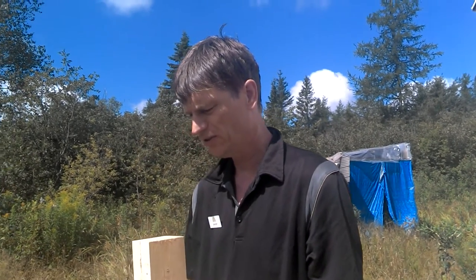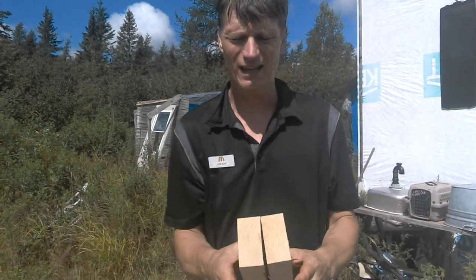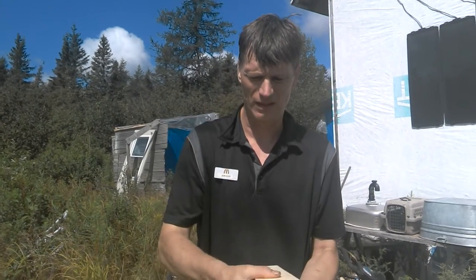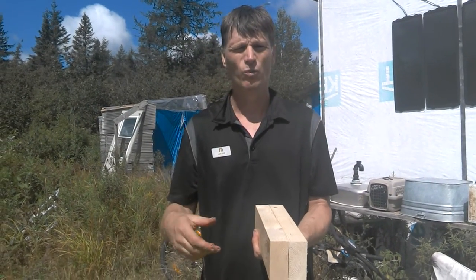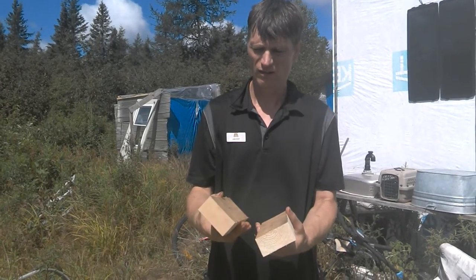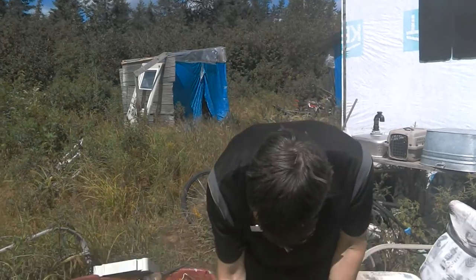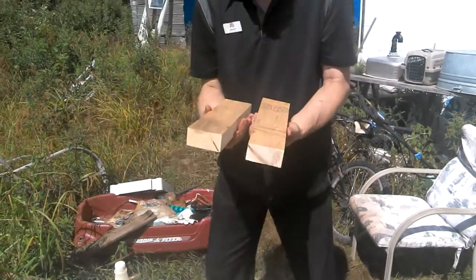What I'm doing here is gluing up spindles for making candle holders. Two matching pieces made from exactly the same piece of wood — that way when I glue them together face to face or back to back, the grain pattern will come out symmetrical on the piece and it'll look nice. I kind of glue these up — these are just two by fours — and I'm going to be making two sets of candle holders. These are both prototypes that I have in mind.